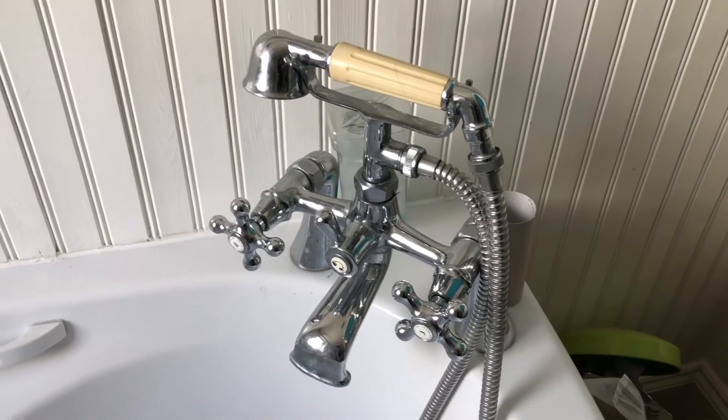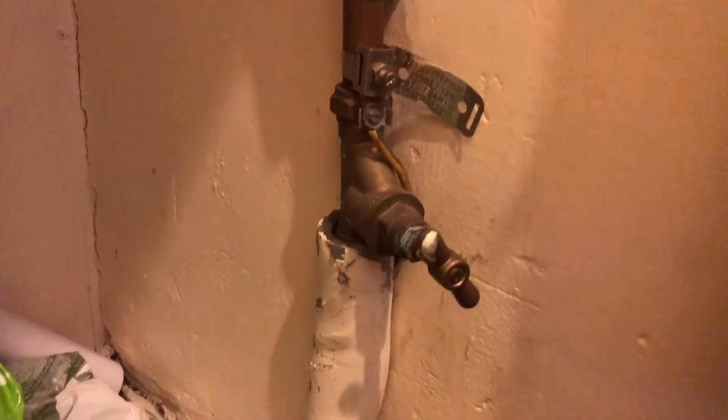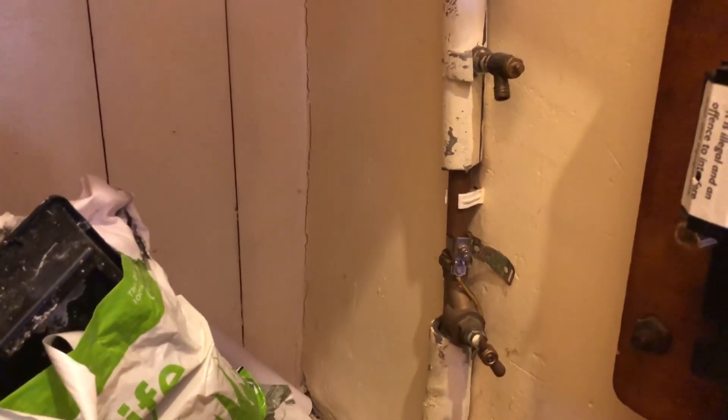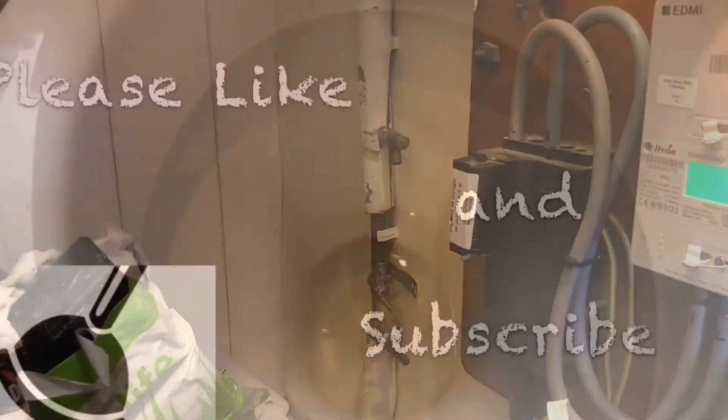We've mentioned the toilet — it can do all sorts of damage to your ball valve. And we do have a set of taps here on the bath where the same thing can happen if you've got cartridge assemblies. Another location for one of these shock arrestors or mini expansion vessels is just behind the stop tap. Please give us a thumbs up if we've helped you out, and you'll understand why you need a mini shock arrestor.